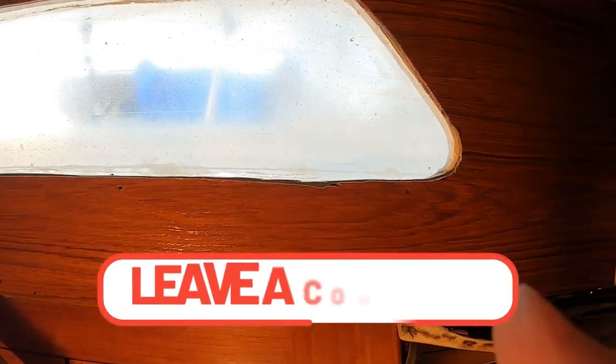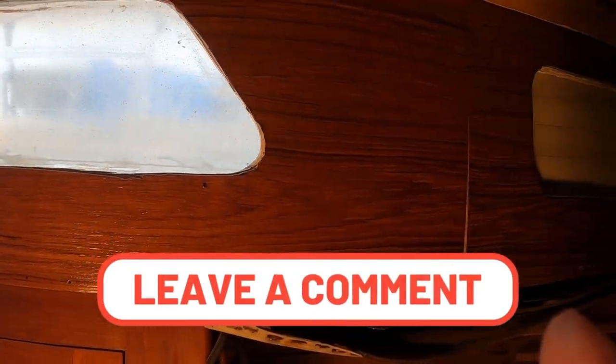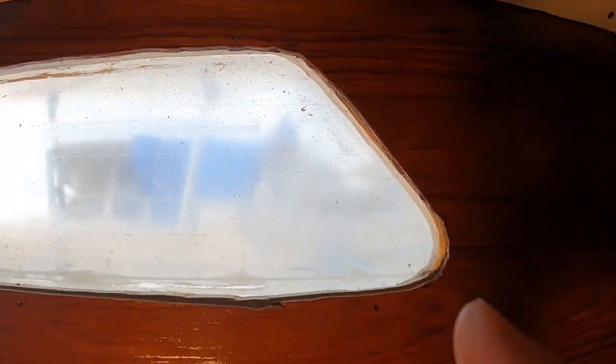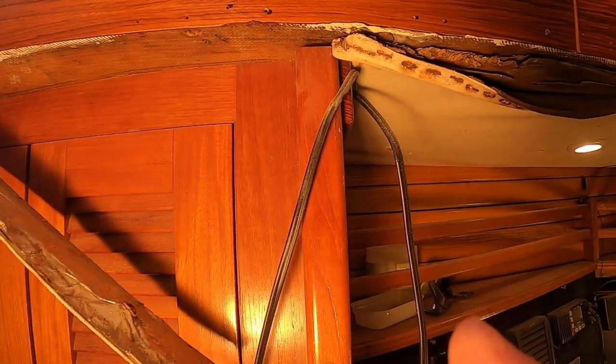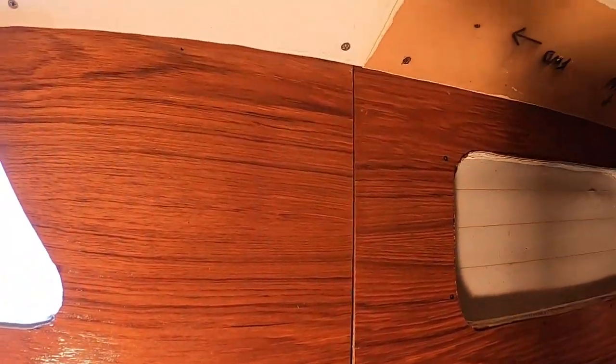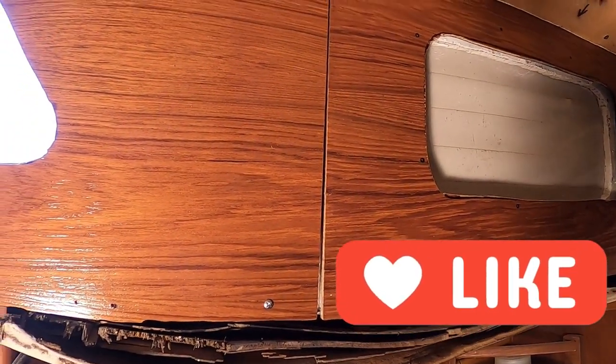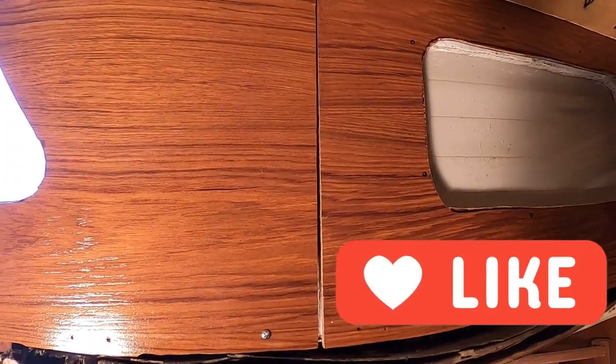So yeah, right in this area here, it was all rotted. You could push your finger through it. And now we have a new panel. And remember, the splice was right here. Right in this area, just barely cut the corner off the window and it went down to here. Now we put the splice, the seam over here. Which I think is a better place for it because it lines up with the seam on the opposite side of the boat.